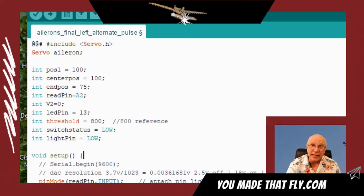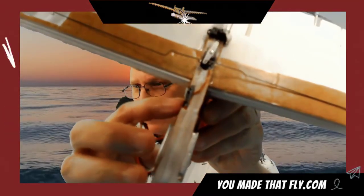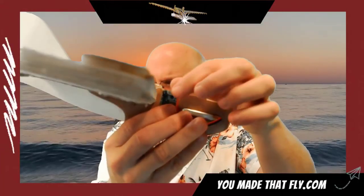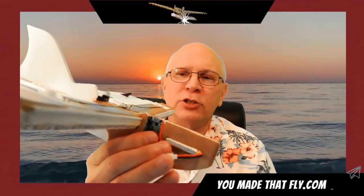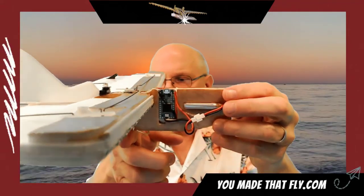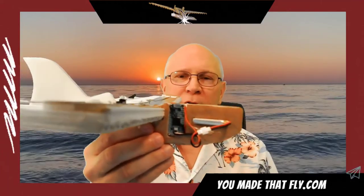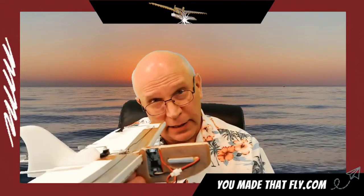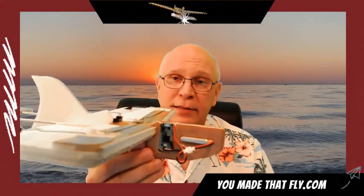And the reason why we chose the Teensy is that we can program this. So instead of having to make a hardware change and changing resistor values, we can just go in and change the program values, much easier. And also on this, we chose to put the port for the programming right at the top here, so it's easy to access. Also notice the bigger battery fits in here, so I'm not worried about sucking too much power. And then this actually takes our center of gravity right along the lines of the wings and just where we want them. So always remember, it's easier to start with a nose heavy plane than it is a tail heavy plane. And then once we get the thing balanced out correctly, we can actually just adjust the size of the battery and basically trim out the plane.